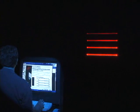Now for most color projectors, you should have at least 3 or 4 working color channels. If you didn't see any projected circles, or if they're all faint, then something is not set right on your projector's color system. First, double check that you selected the proper type of projector on the Number of Color Channels wizard page. Then, check your projector configuration and wiring. You want to be sure that your projector can be controlled by the voltages put out on the QM2000's pins. For more information, look in the Pangolin help file under the QM2000 board section and look for the topic Connections and Pinouts.